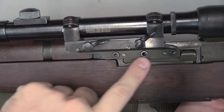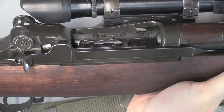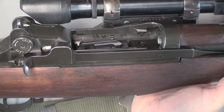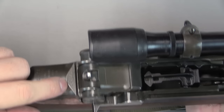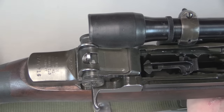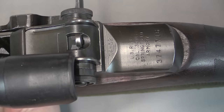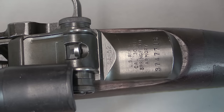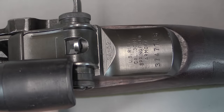There are two pins and three Allen-head screws. Looking on the inside of the receiver, you can see all those things coming through. Standard Army practice was to peen those screws in place so they wouldn't back out. This particular rifle is a Marine Corps rework, which is why those screws are not peened — it has a 1950s barrel marked SA-52. On a standard M1C you won't find anything special: it's not going to be marked M1C anywhere, it'll just say US Rifle Calibre, Springfield Armory. The serial numbers will be between 3.2 and 3.8 million.